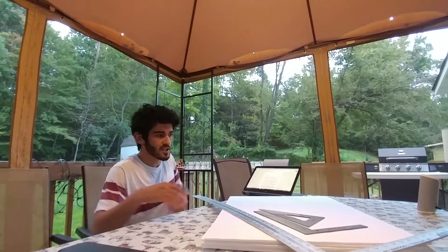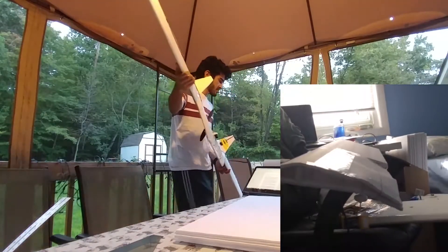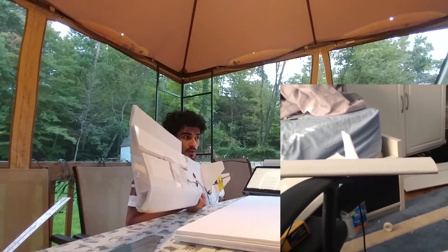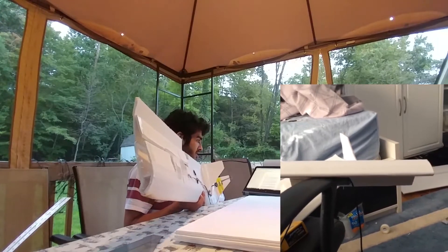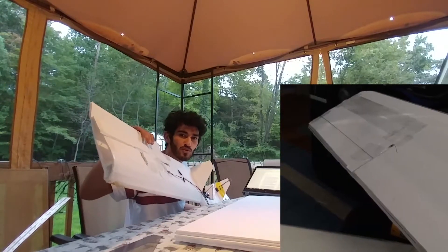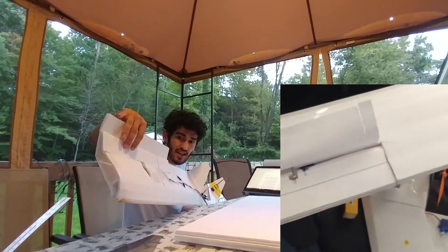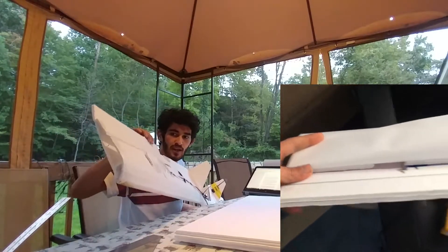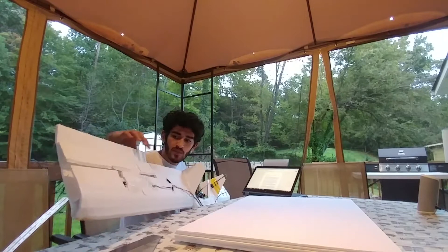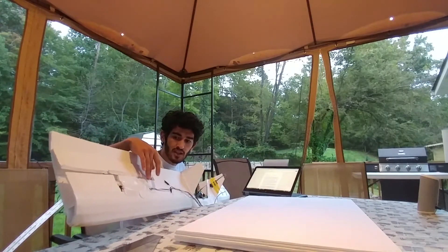The first change is the elevon design. I first designed these elevons hoping to reduce drag, keep the aspect ratio low, and not break up the airflow within the aircraft. But the hinges were at the bottom, and that gives more room when moving the ailerons down but not much space moving up — that's why I had to add extra pieces at the end. What we're changing is the hinge is now at the top. I'm hoping to not add an extra piece of foam board at the back, and that the hinge at the top will have enough surface area.